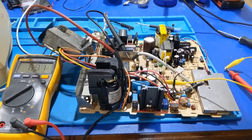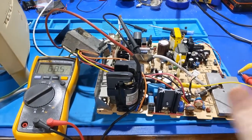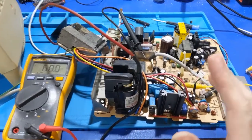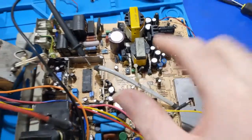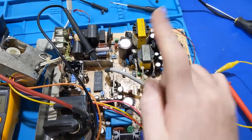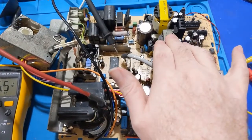All right, so in an attempt to use the other flyback transformer, because the transformer that I had on here for testing is my only one, so I can't give that away or anything. To use the 550 and 575 transformer in an attempt to find a happy medium, we're going to try to adjust the B plus output from this board. This particular board has two power supplies. This is the computer power supply. This is the monitor power supply. The monitor power supply runs all the time. That's why these Zener diodes get baked like this. Even when it's in standby, this runs all the time, okay?